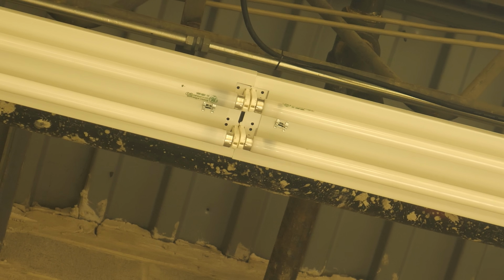Operating life was. Getting rid of the electrodes would mean getting rid of the weak point of the fluorescent lamp. In a conventional tube, the electrodes slowly wear out in a process known as sputtering. This happens the most at lamp startup, but sputtering still happens throughout continued operation. Over time, this causes the ends of the tube to darken.